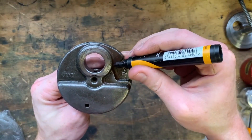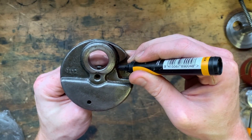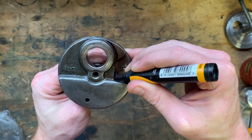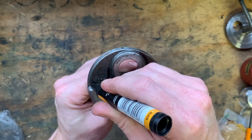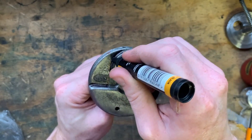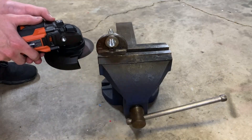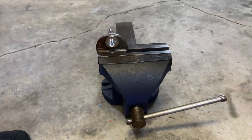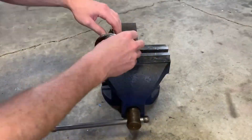I'm just going to lob off what isn't the counterweight with an angle grinder, and then clean it up with some hand files and a paddle wheel and see how we go. Let's not worry about the math and science involved - the 1mm cut-off disc and the angle grinder makes short work of the crankshaft.